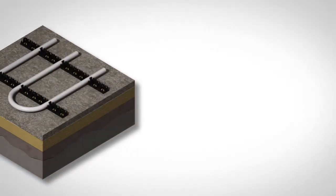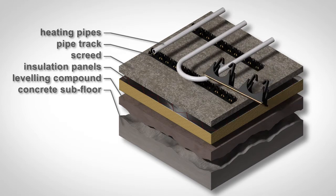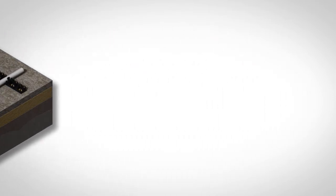In addition to avoiding damage, the CLIP Rail system uses a built-in self-adhesive strip to lock the clip rails in place, and it is therefore vital that the floor is level prior to attempting installation.